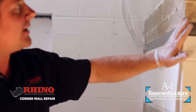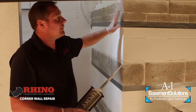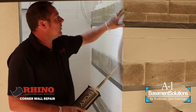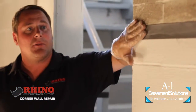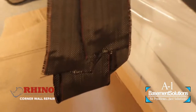What we've done to prep it is we've scarified the wall and removed any paint. If the wall was clean with no paint on it, you would still lightly scarify it, then make sure you get into the aggregate, which you can see in the wall, to bond it farther into the block for a stronger bond. We've taped off the bottom so the epoxy doesn't run too far, taped off the floor, and repaired that.